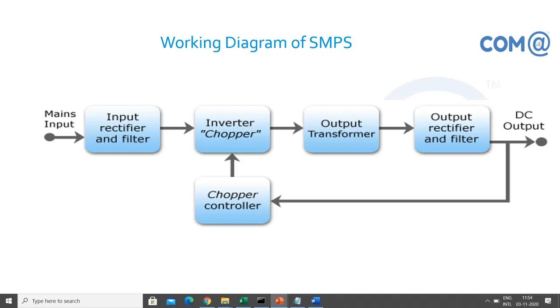It will be storing the charge while the power is available, converting AC to DC and storing the charge in the battery. So when the power is down, the battery will provide the DC. The converter circuits will convert the DC into AC. So you will still get power supply from the UPS for another 10-15 minutes, based on the capacity of the UPS. In an office, they will have higher battery capacity, so even 2 hours, 3 hours you can run on the battery power supply.